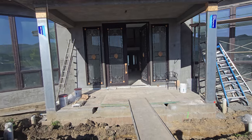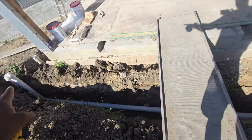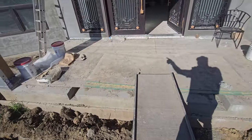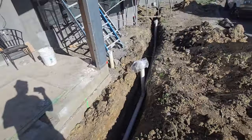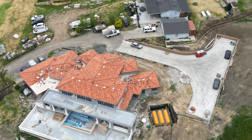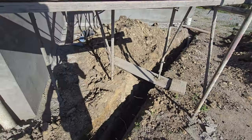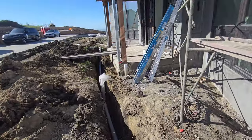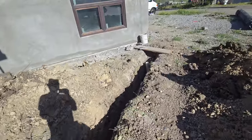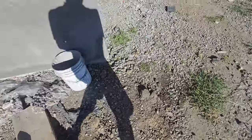We're now in front of the house. We've got a solid SDR 35 going straight through here and we're going to tie the downspouts into this one. This pipe is going to go to another biodetention on the other side of the house. All the downspouts — this is going to carry pretty much all the water to the other side of the house. The pipe ends here, but it's going to come over here.